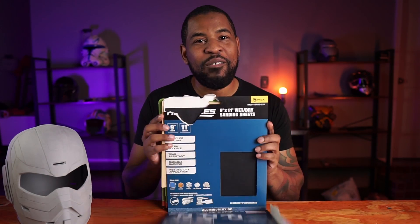Now that we're done printing, it comes to sanding. There are a few easy methods. The first is hand sanding — it's always important because with 3D prints, hand sanding lets you get into those little nooks and crannies and sand down as much as you want. I have varying sandpapers from different grits, from 60 grit all the way up to 1,000 to 2,000 grit. The 2,000 grit is usually for wet sanding or fine detailing, while 80 and 60 grit is to knock those initial layer lines down, saving you time.